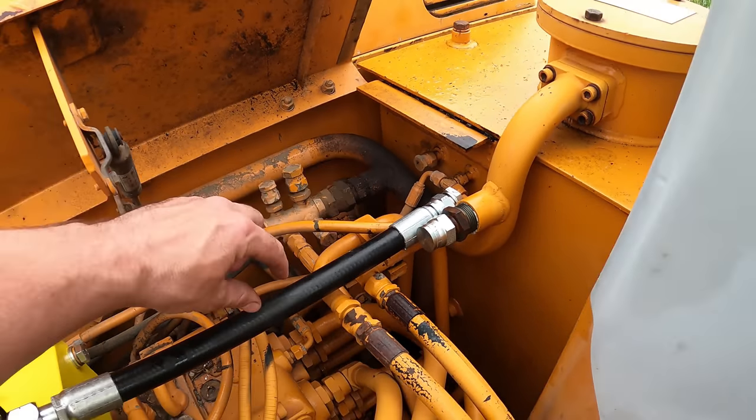So the first thing I got to do is press it back into place. I'll put a piece of steel underneath this side of the bucket, push down as hard as I can, and then hopefully close that up the best I can, and then I'll weld it, and then this time I'll put some straps going across it too to hold it better.